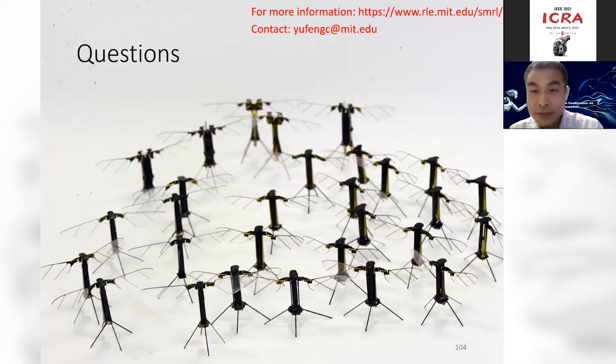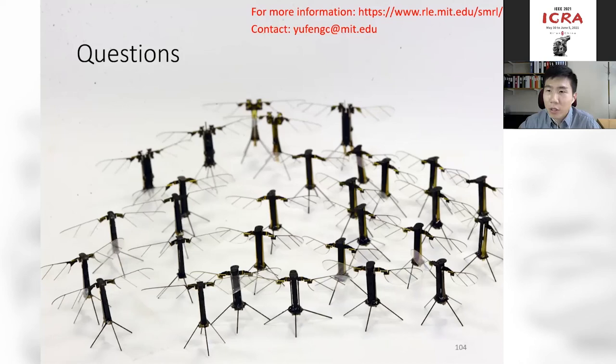Next question: since the insect-like robot is very lightweight, how do you deal with large environmental disturbances such as strong wind or water flow? Compared to its size and weight, the robot can actually overcome relatively large disturbances. It can hover in ambient flow on the order of 0.5 to 1 meter per second. Like insects, flying outdoors in really strong wind would be very difficult, but for most indoor environments the robot performs well. The capability to fight larger environmental factors is still an active area of research.